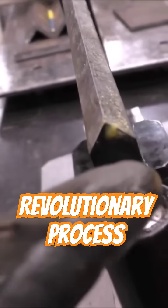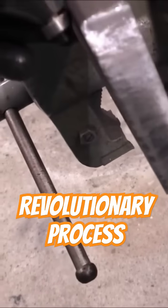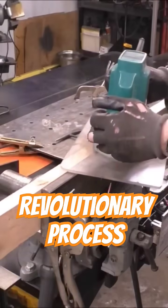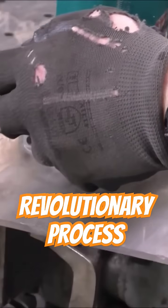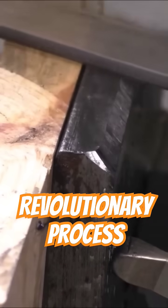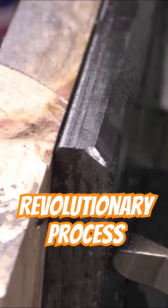The next thing we got to do is put this profile on our punch. Use a router with a carbide bit that's 45 degrees — it's got a bearing on it. This right here is the secret sauce, guys. This is what I am just totally blown away with. This worked incredible. That is literally just a wood cutting router with a wood cutting router bit. A lot of guys I see using a grinder, and I could just picture having this really wavy uneven edge.